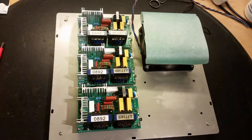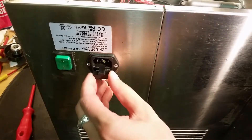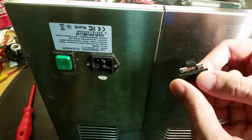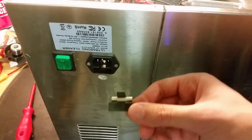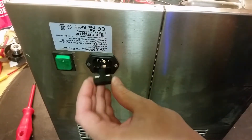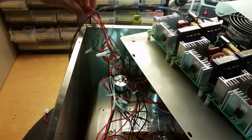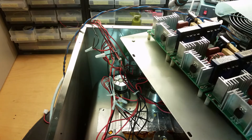Circuit boards are back in place — we removed one and repositioned it. Now we need to replace the fuse here. You can see how blackened that fuse is — looks like there was a very hard short circuit. It's a 10 amp fuse, so I want to put a 10 amp ceramic fuse in there. Now I just need to connect the fan and all the other wires to the circuit boards and screw it back together. We'll see if it works.